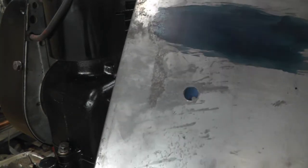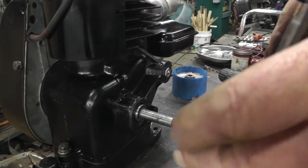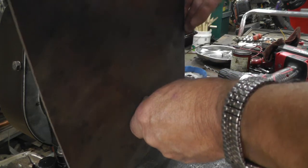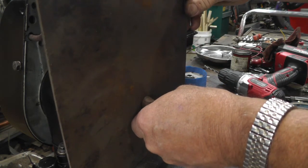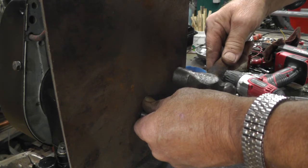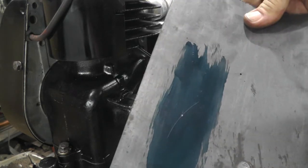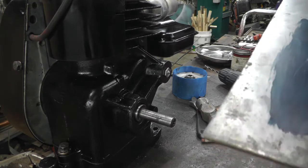Okay, I got my 1/2-inch hole. Throw a little marking die on there. And I'm going to put her up in place. And I'm just going to give it a little scratch. That'll help me identify for sure, in case there's any question about which one is the mark. And we'll give her a good smack. Right there she is. So that was 5/16. So I'll get a 5/16 hole drill there.